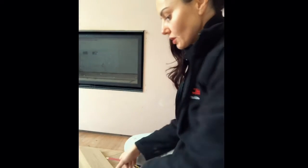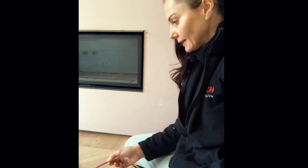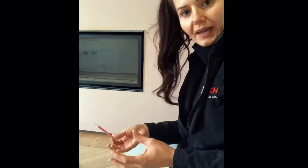But when you have, like the other side, lots of boards, I think the better thing to do is measure up one board and then set up a kind of little jig or whatever you might call it on your miter saw, so that you can just pop them in. You don't need to measure and mark every board. You've created almost like a template there on your miter saw, so that each board just slides in and chop. I'll show you. I'm not explaining it very well, but for a long run that works out much better than putting all your boards together and trying to mark them, or individually marking every board.